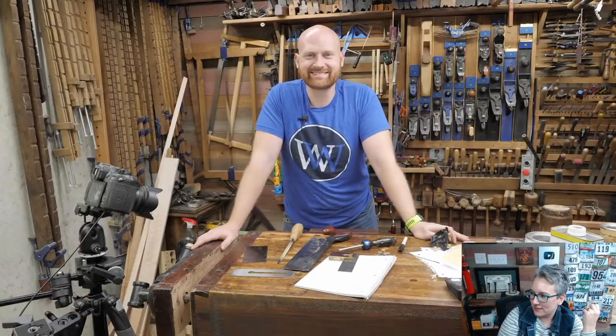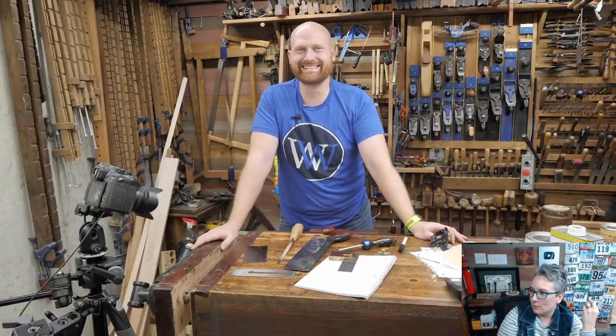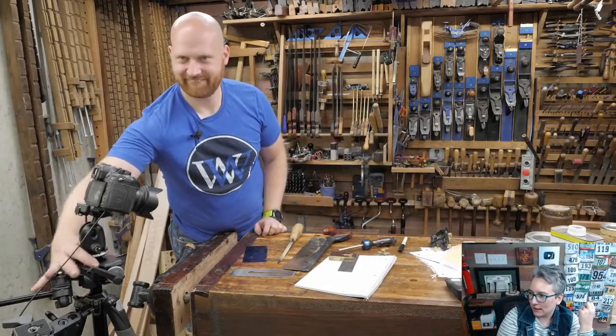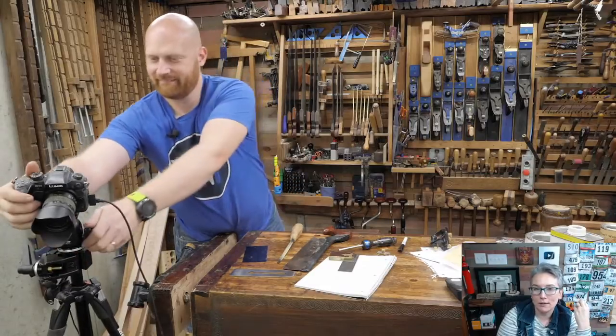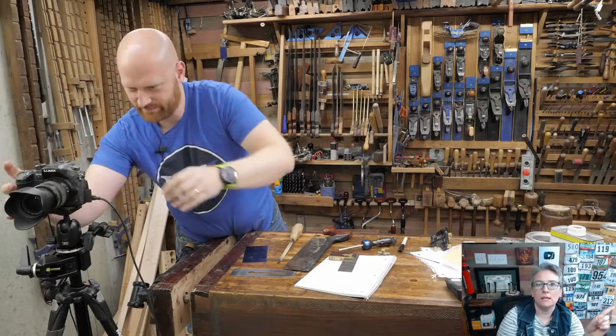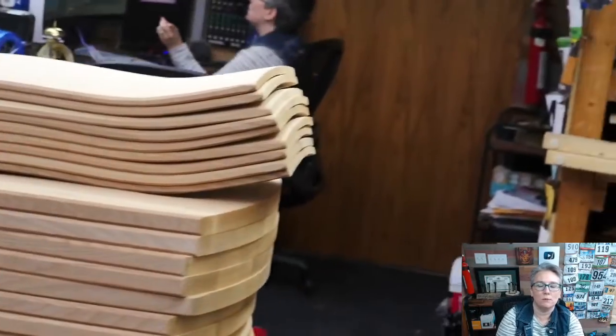All right, Ari Stephen asks, Sarah, I know the workbench was a physically demanding project. What was the most important lesson you learned from that project that you would like to pass on to future beginners? Ooh, the most important lesson? Spend the money on epoxy, because PVA sets too fast and you're going to do too much flattening with the plane.